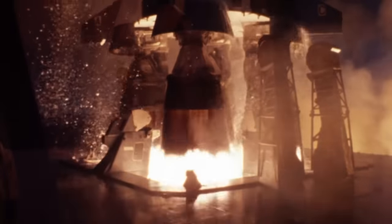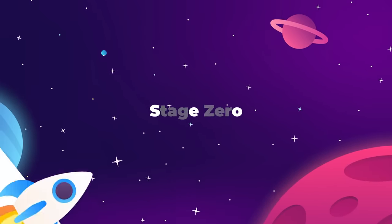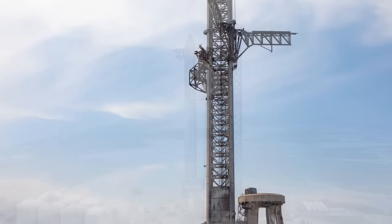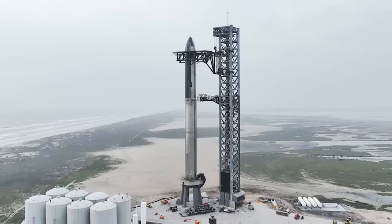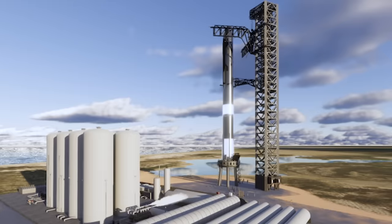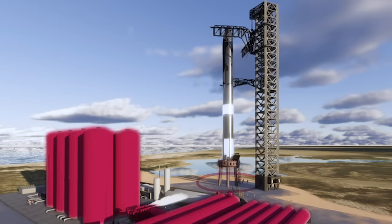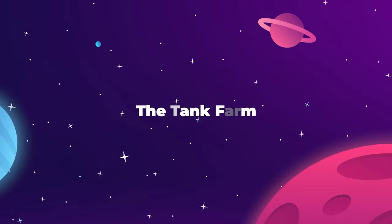This is the way that pretty much all rockets have been launched since the late 1950s. Not much has changed — until now. The ground system responsible for launching Starship is an incredibly complex collection of infrastructure, often referred to as stage zero, implying that the ground infrastructure is just as much a part of the Starship rocket as the booster and the orbiter. There are four pillars to the Starship launch process: the tank farm, the flame diverter, the launch mount, and the launch tower. Each one serves a vital purpose in getting the Starship Super Heavy fully integrated, launch prepped, and into the air.